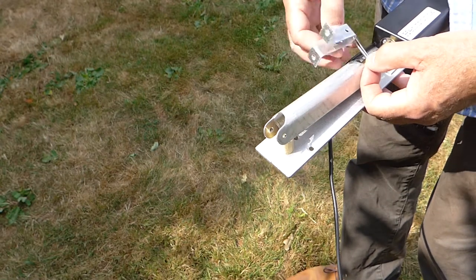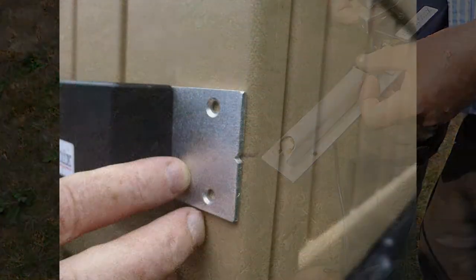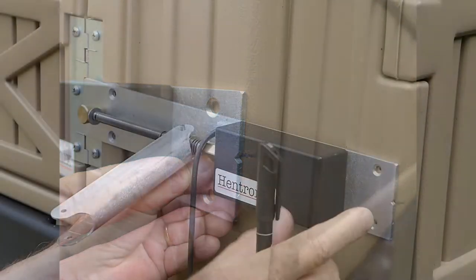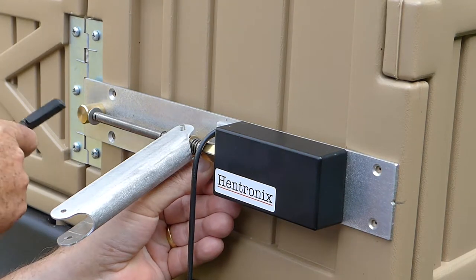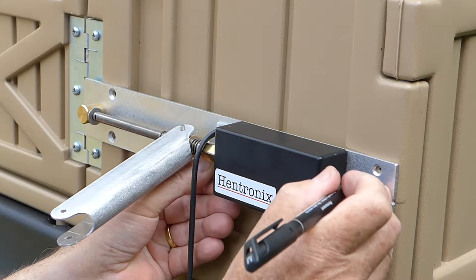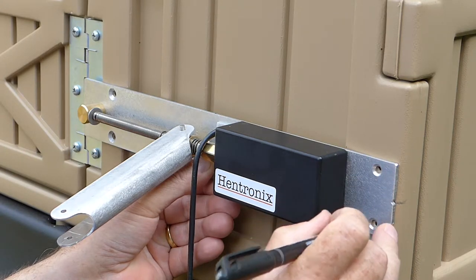You can now get the mechanism itself and take the split pin out. Align the little notch at the far end of the base plate to the pencil mark you made on the right pillar. Making sure the right hand and now the left hand notches are lined up with the pencil marks, make pen or pencil marks in each of the screw holes.